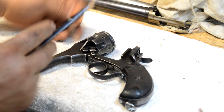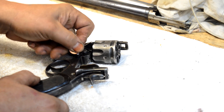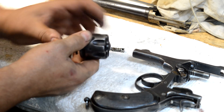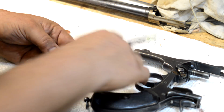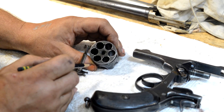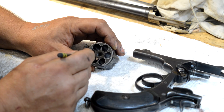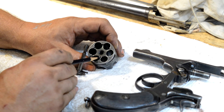We're up inside the operational revolver and noted a couple of things. This pin right here — I've got my finger behind it so you can see it — that pin allows the star to stay aligned and not rotate. On the other gun, the star is actually allowed to move. This can actually pronate out of position. It's not something that would keep you from shooting the gun, but it's just not right. There's a five-sided hole down inside that will eventually wallow itself out.